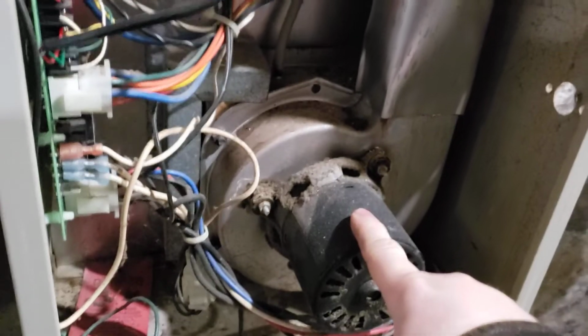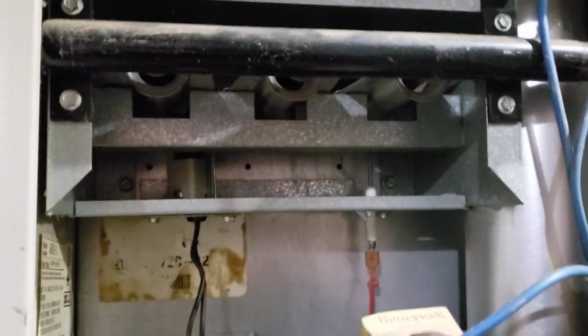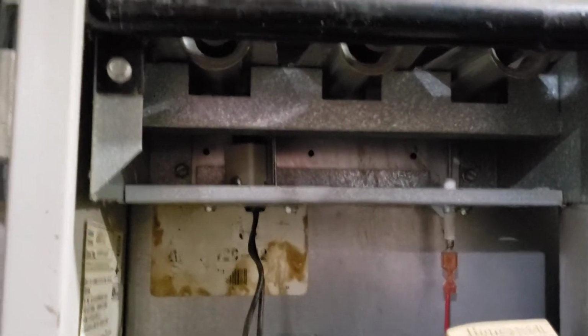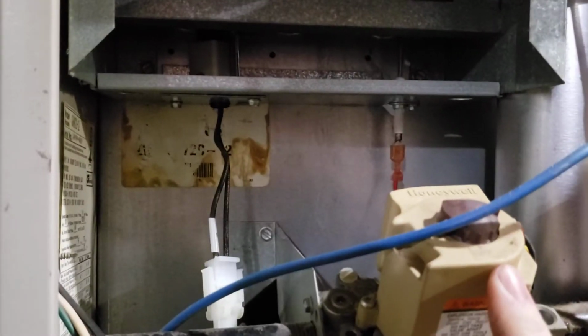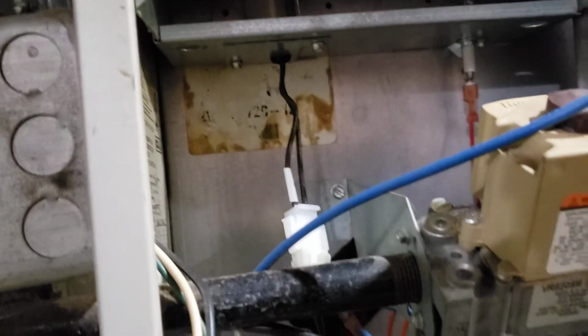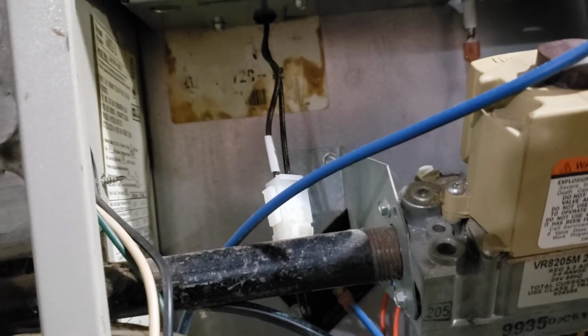Alright, there's this pre-blower to move air through the flame tube and ductwork and everything. There's a name for it, I can't think of it. Then we should hear the solenoid click to turn on the gas. Actually, we should have a relay click here first, I think, for the igniter. Okay, I heard a relay click.